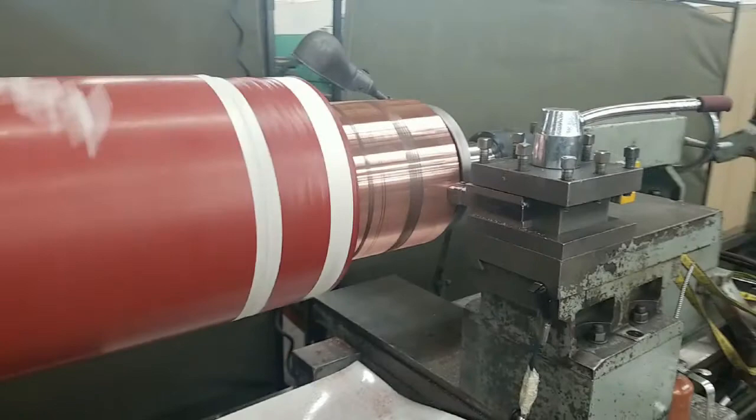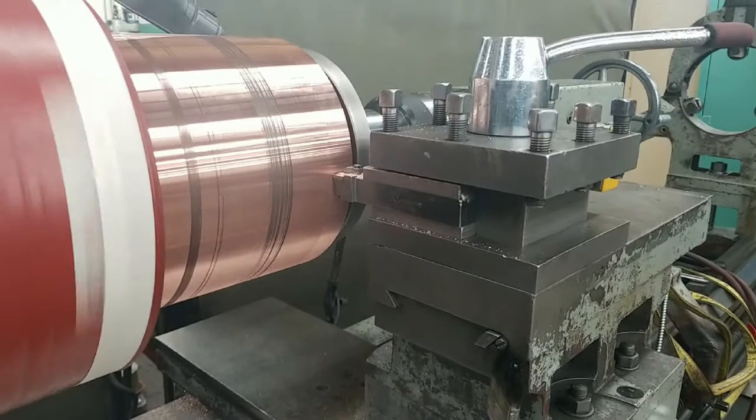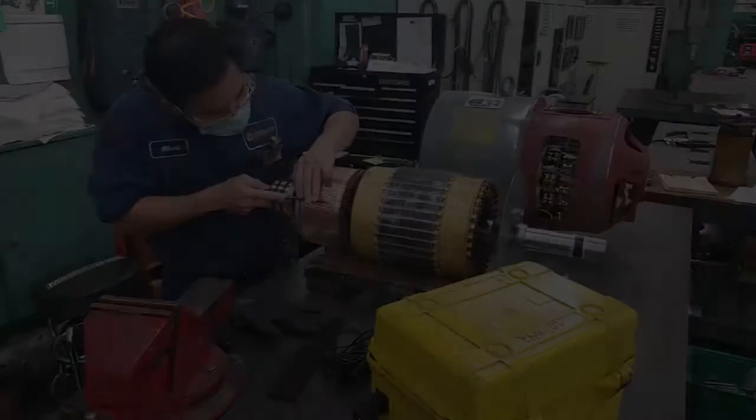This results in a costly repair. Here we are clean cutting the armature's commutator so that it is a smooth surface for the brushes and it is at least one thousandth of an inch in run out in comparison to the bearing journal.